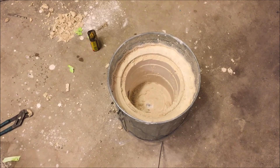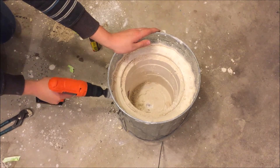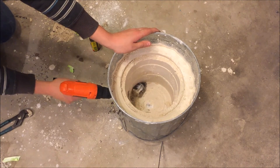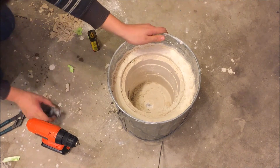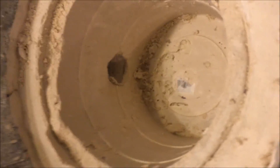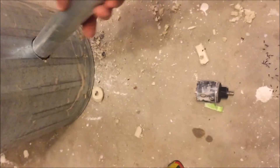Okay everyone, something a little funny happened with the camera — I'm still at the same spot drilling the hole for the air vent. We have a one and a half inch hole saw bit. This is going to go into the side of the drum at about a 45 degree angle, ending up right at the base. So if your crucible does fail, all the metal will not dump onto the ground — it will just sit in the bottom so you can get it later. We're through the hole. So there's the exit where the air is going to come in. Here's the entrance — the pipe goes in. I have a longer one, but this is a one inch pipe. You can see it slips right into the hole, and that goes to right where we'll blow air into the fire.